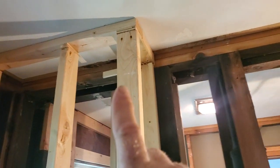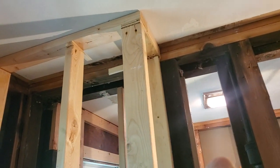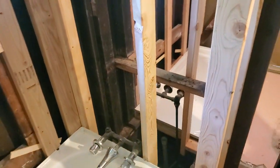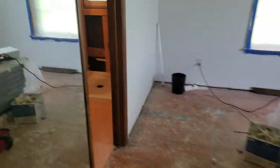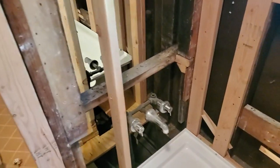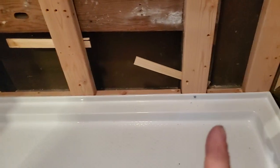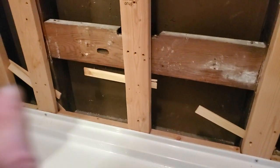You can see I've got shims in behind that, screwed back to the wall, so it's all stable and sturdy. I'm not going to act like a monkey and swing on it, but I promise you I've got enough three-and-a-half inch screws in it to hold it. Down here on the base we screwed it in multiple spots and shimmed the wall out along there and then reattached it.